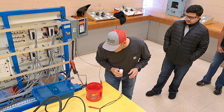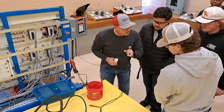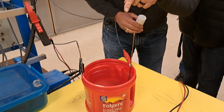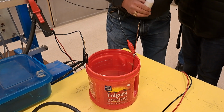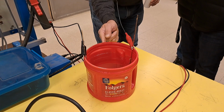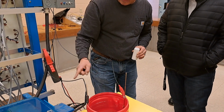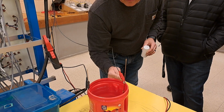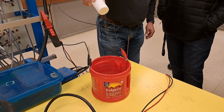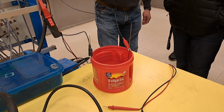Okay, now, don't bump anything. Move in. Listen. Notice the electrodes starting to sizzle, starting to boil around those. Those are getting hot. Why? Because we're running 1.5 amps through those. You can hear it. The water's starting to churn. If I added much more salt, it's going to get more erratic. I kind of like it, don't y'all? Kind of fun. 1.7 amps.